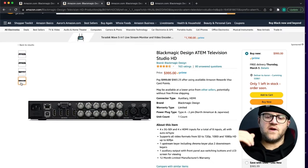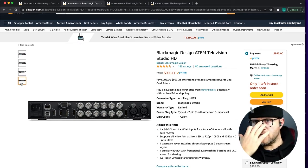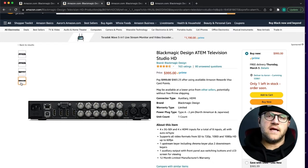I wanna address audio on this guy. This one has very nice professional XLR ins. You get two channels of XLR as well as SDI inputs, which you don't get on the ATEM Mini. So if you have any cameras that are running SDI, or if you want to run longer distances, I highly recommend you switch HDMI to SDI, and I'll put some links to those boxes in the description so that you're getting a quality signal over longer distances.